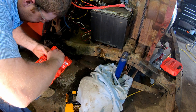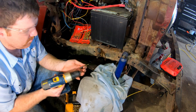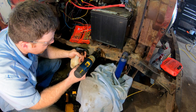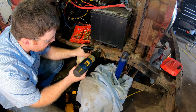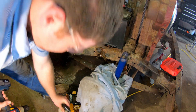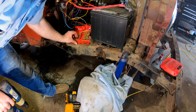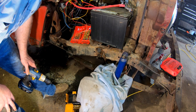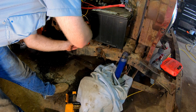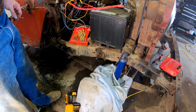Let's try a good drill bit — a 7/64 — and see how this works out. Oh yeah, it's going in and sinking now. That bit should still be pretty sharp. The reason drill bits get dull is because the metal gets hot and turns like butter, and it ends up damaging the bit. So keep using lubricant and take your time.